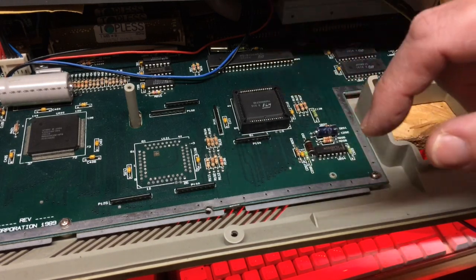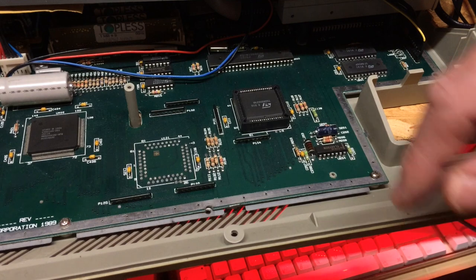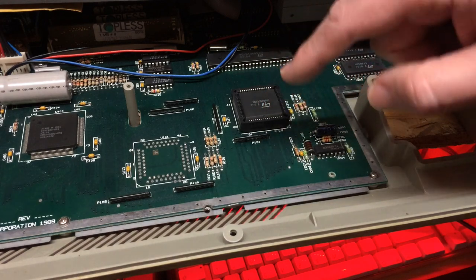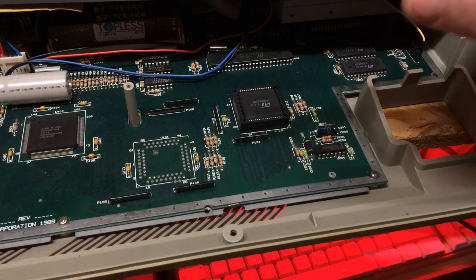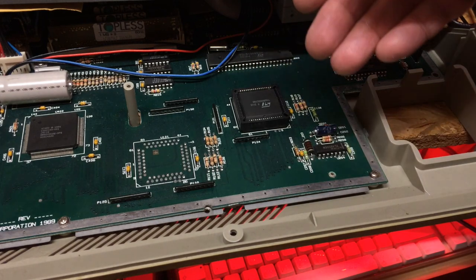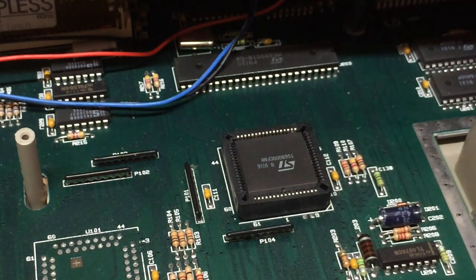So the obvious alternative is, can we make our own Winslow equivalent? Now these pins are half the pitch of the 68,000 DIP that I showed you previously. Here's another DIP up here. They're half the pitch of this. They are, I believe, 1.27 millimeters, or one twentieth of an inch along, which requires some very, very fine pins, which are also very hard to come by. But by getting these very fine pins, and arranging a PCB with the holes in just the right place, which would have to be very precisely machined, we could perhaps poke the pins down in a place where the PLCC's J legs would normally be and pretend to be a PLCC chip.